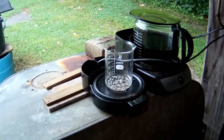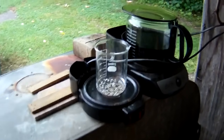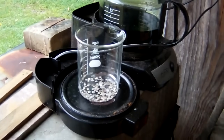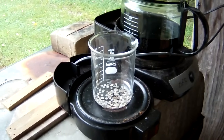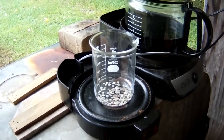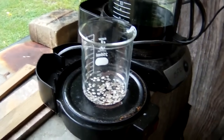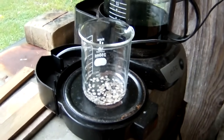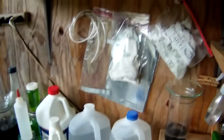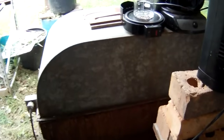Alrighty, we're back outside now, and I have taken my almost 24 grams of contacts and put them in a 250 milliliter beaker with about 40 milliliters of distilled water. I've got them on our little burner. I don't have the burner on yet. And now we have about 40 milliliters of nitric acid, which we are going to slowly add to this beaker,